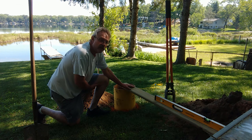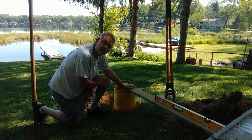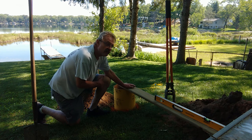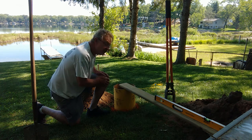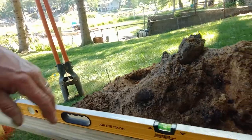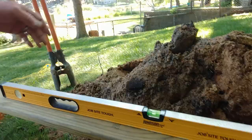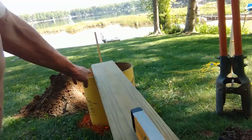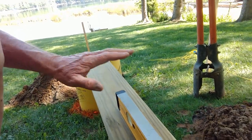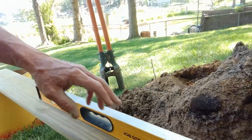I've got the second tube in. The string levels are nice and they get really close, but they are not perfect. So what I've done is taken an 8-foot decking board and laid it on top of both of these sleeves to make sure that I am level. And as you can see, I am perfectly level. Each sleeve that I put in, I'm going to keep hopping across each one of them and checking for level. This will be much more precise than my string.